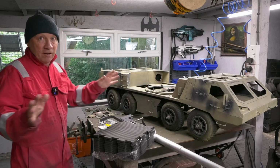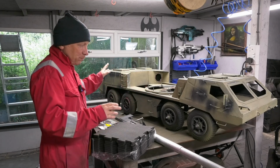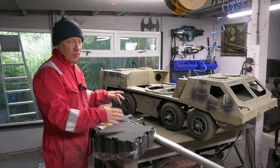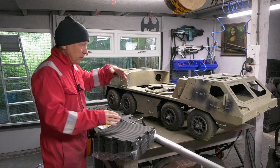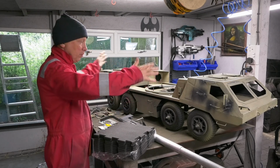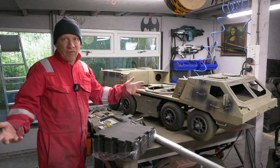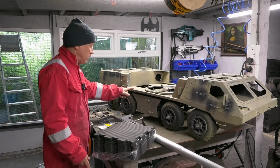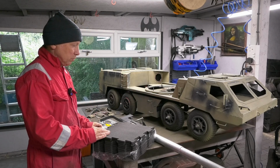I don't use a common chassis earth in any of my wiring, I never have done. I always use independent wiring systems for the earth and for the lives. So there's a live system and an earth system that runs through it. I know it takes more wire, but on a model like this, it's neither here nor there. On the real thing, fair enough, but the minute I try to earth to the chassis, you can run into all sorts of issues with models.